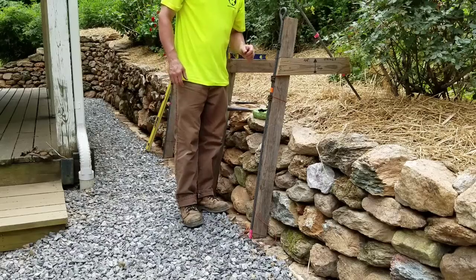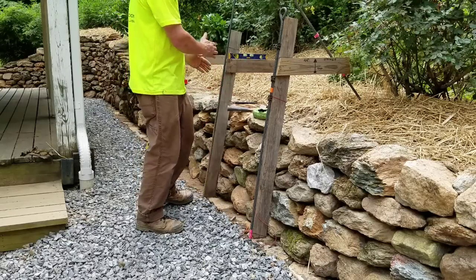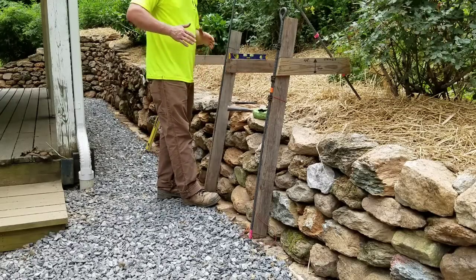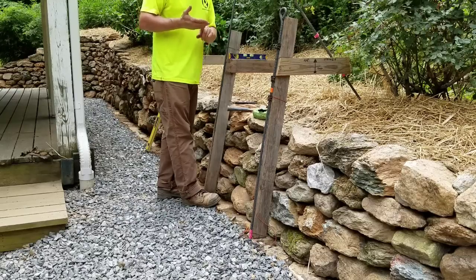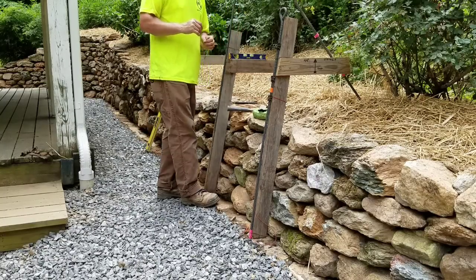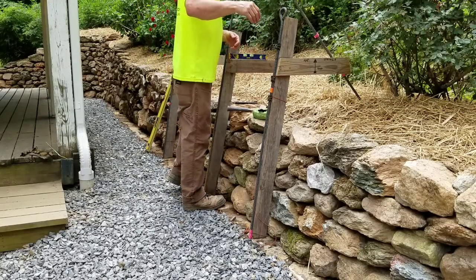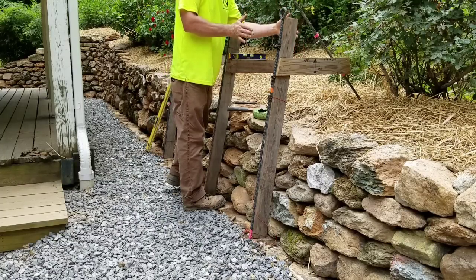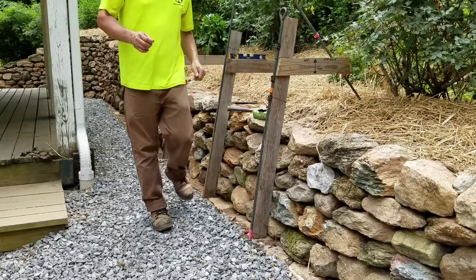I want to talk about some of the different methods of tying a string to the frame. The reason for the batter boards is it allows you to have a nice guide to build to with your string lines — that's the whole purpose of the batter boards. Another benefit of having a batter or any kind of angle is you're saving time and money on materials, because with the wall getting smaller at the top, you're using less material. Typically you can do a back frame — a lot of times I'll just use a piece of rebar as an angle. I just started wide at the bottom and came in at the top because it's a double-sided wall, which is a Yorkshire style from England.